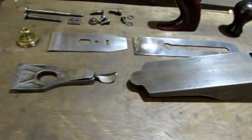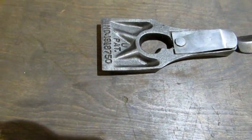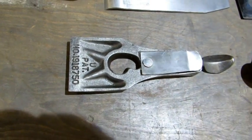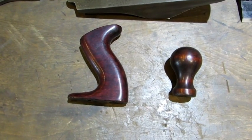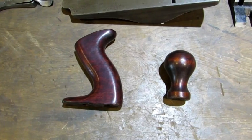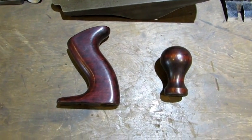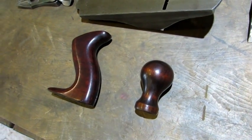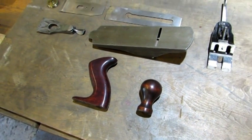The finish was shot, so I refinished it — turned out pretty good. Got a nice even patina left on the body, and it's got the patent from 1918 on the back of the lever cap. If you've ever tried to refinish the old hardwood knobs, you know what a pain in the butt that is. Whatever Stanley put on them was some kind of thick goop with a rosewood color in it and it's hard to recreate, but these look pretty good. So let's put it together and give it a test drive.